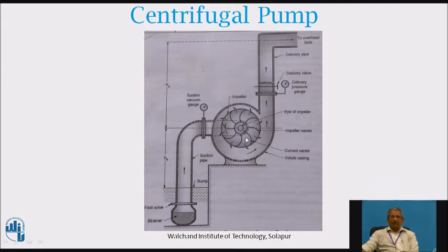When it is coupled to the motor and when we start the motor, this impeller will start rotating. But the main thing is that this impeller is not concentric to the casing. The casing circle and impeller circle are not concentric to each other — it is eccentric to increase the volume to accommodate water.